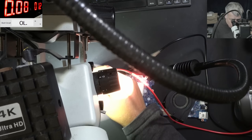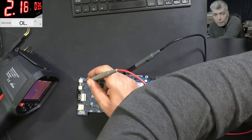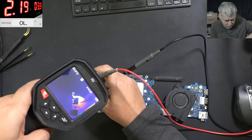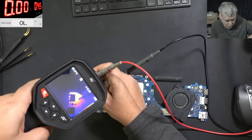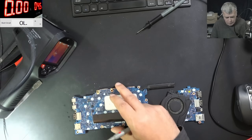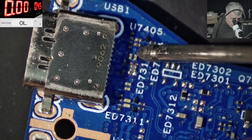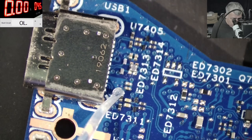We're probably going to smoke that port anyway so I'm raising the voltage — about 2 amps now. I think it's the port itself — or not? Let's try with alcohol to see better. Also there could be something wrong on the other side — there are two capacitors, another plus track. With alcohol we can spot the fault better.